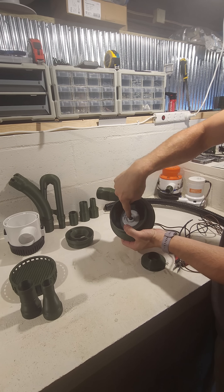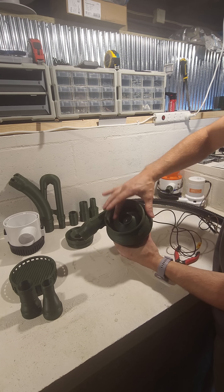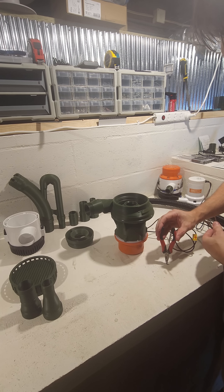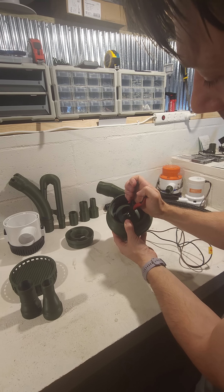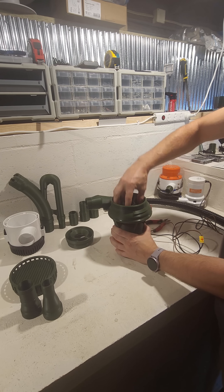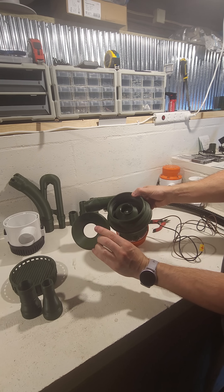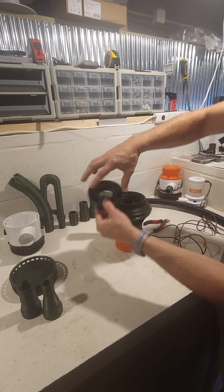You can see the base shaft is now centered and ready to receive the impeller. It should spin freely, at which point you grab it, line it up, and sneak it into place. Do remember to put that c-clip in — if you don't, this will come loose. Once that is installed, this faceplate nicely mates up to the pump on the inside, and on the outside it has a bit of a velocity stack.